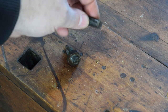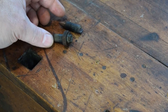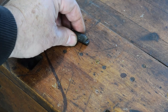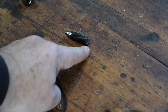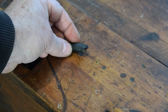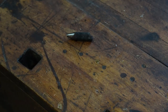And here's the one we broke, and here's the replacement that I happen to have in stock. If you break one of these, go to eBay and search and see if anybody's got any for sale. In this case, had I not had one and had I not been able to get a replacement, I just would have ground off the broken piece here and then taken a Dremel with a cutoff wheel and cut another groove in it, and there'd have been plenty of threads to use. But this one, unfortunately, we're not going to have to use. We happen to have one in stock, so let's move forward.